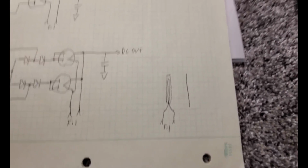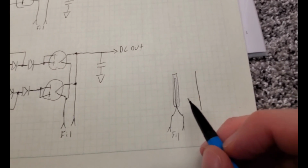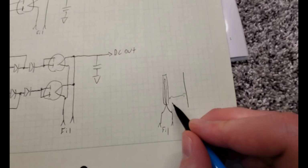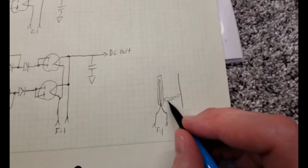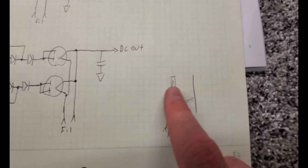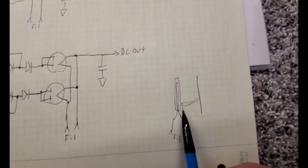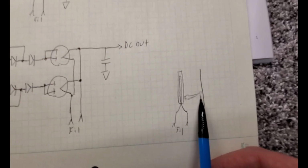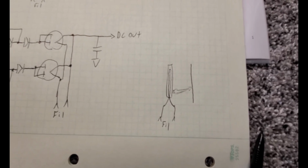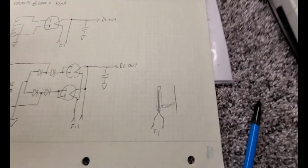But on startup, if the filament is coming up and the cathode, that I've drawn as a square outside the filament, is starting to warm up, and maybe it's warming up non-uniformly, or the gap between the plate and the cathode is a little closer in an area, you can get a hot spot where you get all your current density in one area of the cathode, because it's not uniformly heated and you don't have a uniform distribution of current density, because you don't have free electrons everywhere around the cathode. So with this hot spot, you can get really high current densities in a small area that has to flow from the cathode to the plate. And if there's any residual gas in the tube, this really high current density will yield ionization of any of the residual gases in the tube, and an arc can be sustained because now you've got all these free gas ions floating in what should be a perfect vacuum. And I think that's what's happening here.